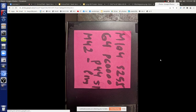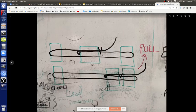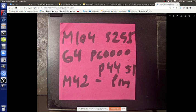We did this the other day, right? I took this note because we're discussing how to trigger individual pins. There's a boatload of pins, like 50 of them, that we still have available on an Arduino. M104 was to heat. M42 is a command that you would type in, like you have G-code files that you put in on Marlin. If you type in M42 P44 S1, that would turn on pin 44. I think that's for 1 second, whatever that is.